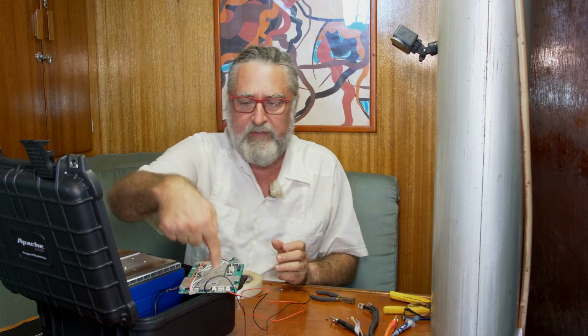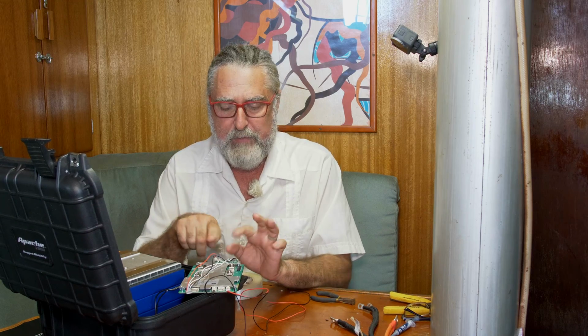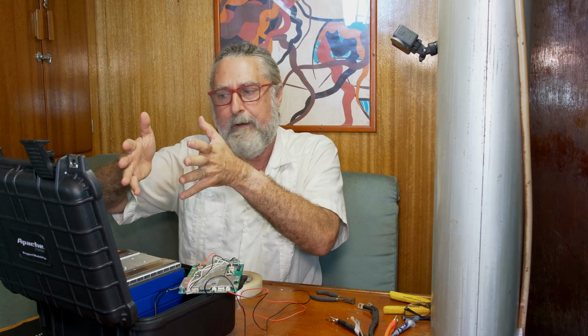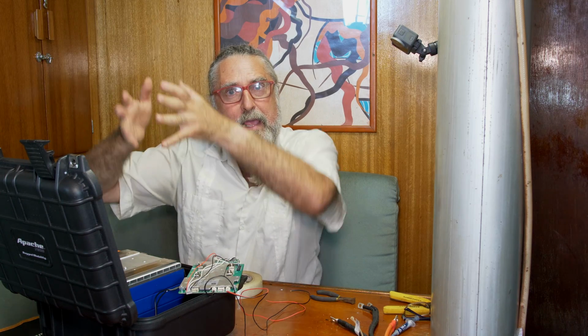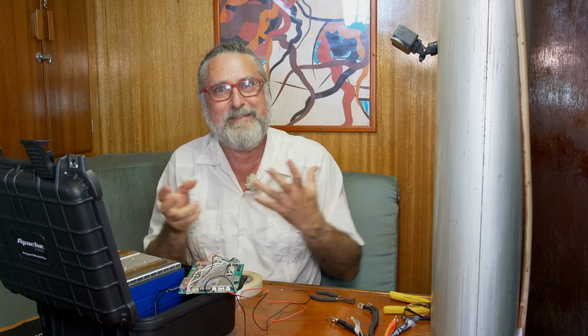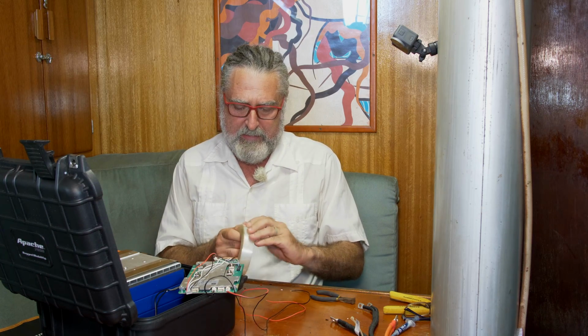It usually becomes heat. This guy can only make heat. It's got resistors. That works, but he's limited. If he tried to draw too much power, it would just get hot and become a problem. This guy, being an isolated power supply, can actually take power from the first cell, if it's too high, and deliver it into the next cell. I mean, that's more efficient, yay. The efficiency doesn't matter. What matters is the thermals. That energy is going somewhere and not making heat. So the thing can move a lot more power because it's not trying to dissipate the heat. Put a little tape on it to make it look halfway decent.